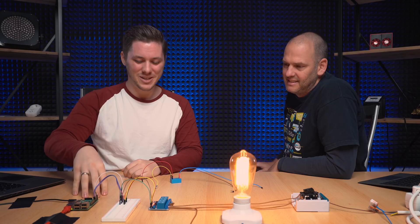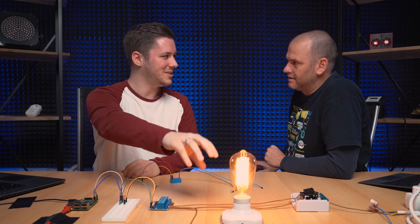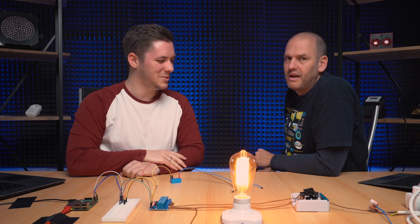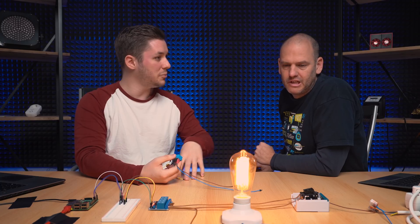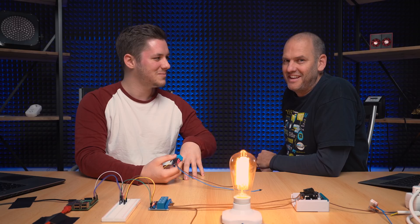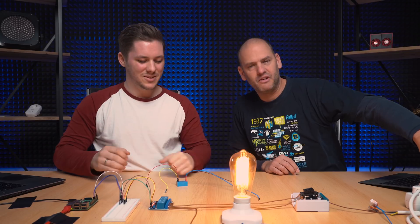We need some kind of a feedback loop to tell Home Assistant if the light is actually on or off, even if it doesn't know — because the relay doesn't know which of the two travelers is the active one. Therefore the transformer comes into play. We cannot connect the regular light bulb electricity circuit to our Raspberry Pi because the Raspberry Pi works with 3.3 volts or 5 volts and our electricity circuit is 230 volts here in Germany. So we need a transformer to convert the 230 volts AC down to 3.3 volts DC.